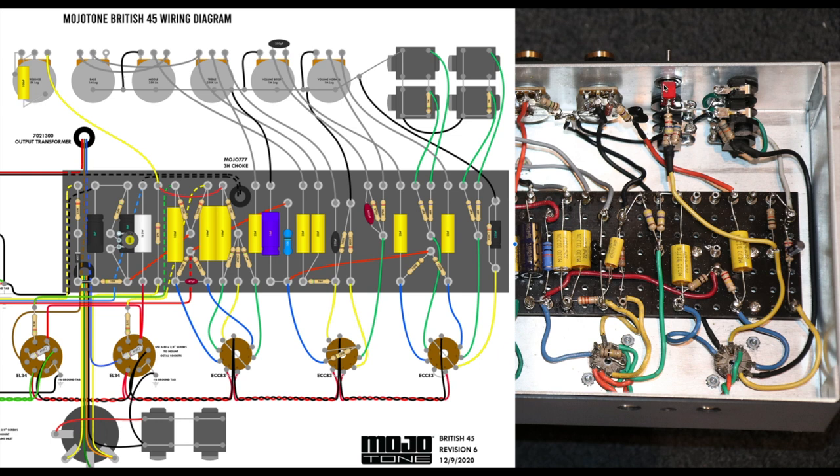While this pitches up, let's talk about this structure switch. Here it is here, right? I'll talk about what these resistors are in a second, but the first thing to note is that it connects via this yellow wire here to this side, which is the tube side of the 10K cathode resistor for V1B. What it effectively does, right, is the middle of the switch is, it's an on, off, on three-way switch, and the middle lug of the switch is grounded. That's what that ground wire there is. And I've just grounded it across here on the ground that's available here for the input jack.